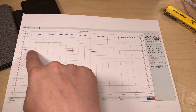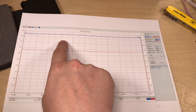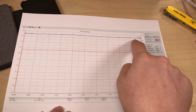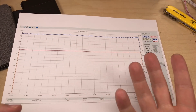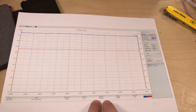Yesterday I did a discharge at one amp. On the graph the left-hand side shows voltage, which had an interesting step in it — the voltage would sag slightly, then the microcontroller inside would say 'I'm dropping voltage' and lift it back up. That was quite interesting, becoming more frequent as the LiPo discharged. It delivered pretty much five volts at one amp, and I managed to get 23.89 watt hours out of it.